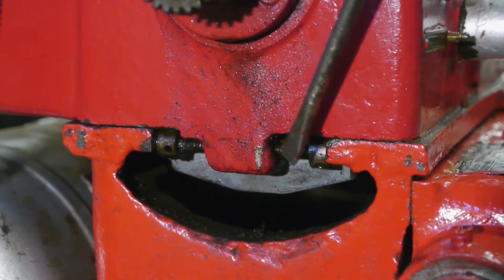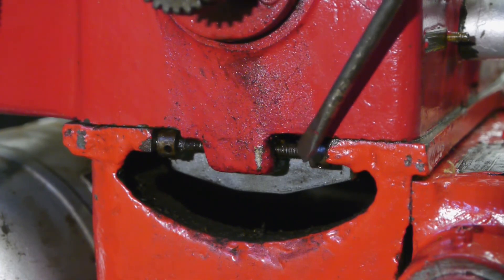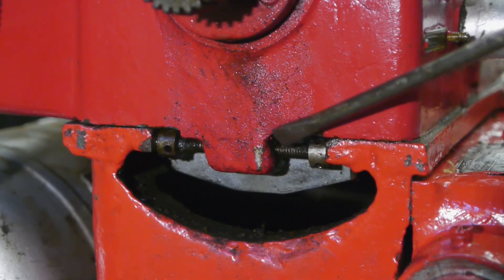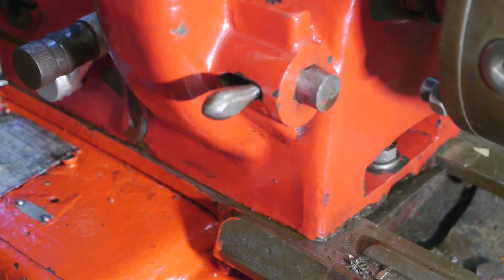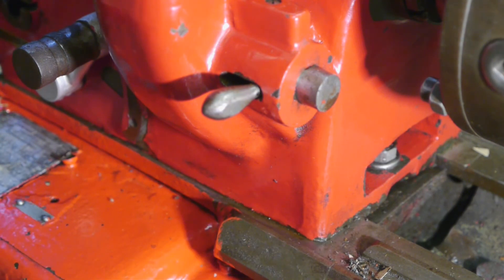So the rear can be adjusted but the front can't, and I wonder if I can adjust the rear enough to bring things back into alignment. There is something going on because I had a look underneath with a mirror and it looks like they welded two clamps together, and I can't figure out why. Looking at the side it doesn't look like the head is mounted at an angle. So if the front can't be adjusted and the back can, why didn't they line everything up? Why is there so much offset on the tailstock? I'm thinking this bed or this headstock might not belong together.